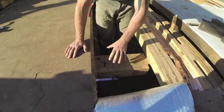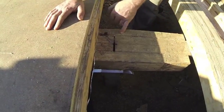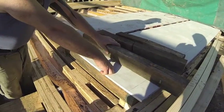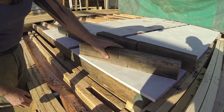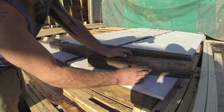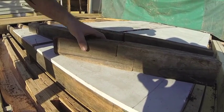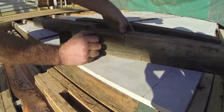Here we have a bearer join — a halving join. If we just scoot over here, Matt has prepared a few different types of bearer finish joins that we can use. With the halving join system, we'd usually have a 100mm stump, with 20mm bearing of the full bearer on each one, then a join of 60mm over the top. Usually we put the pin or bolt straight through and then a nail plate on each side.